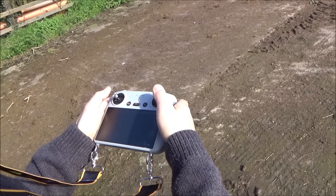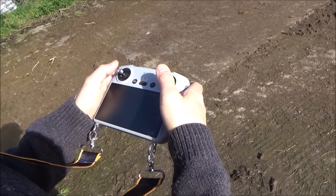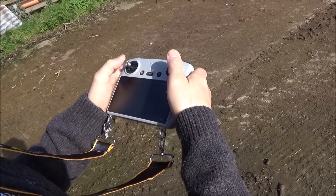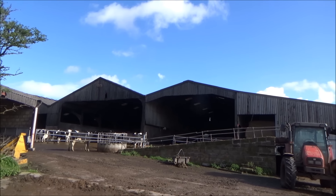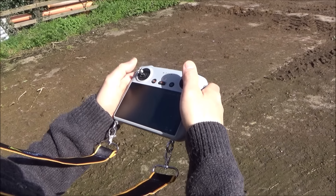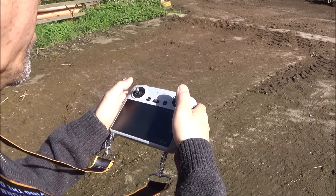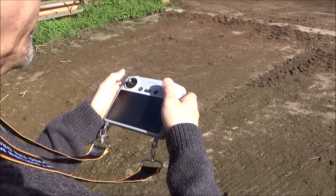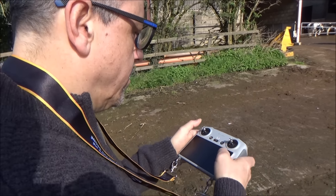In between there — around now — can you look down? I don't know how tight you can get. There's no obvious sign of any grass. No obvious sign of grass, so it's probably a joint failure. I can't really see it clearly. I'll be able to look at that on a bigger screen. So that indicates to me that probably there's a joint gone rather than an actual blockage. Gary's just switching into photo mode to zoom in on the pictures. It's between the third and fourth roof light, which is kind of where we are at the moment.